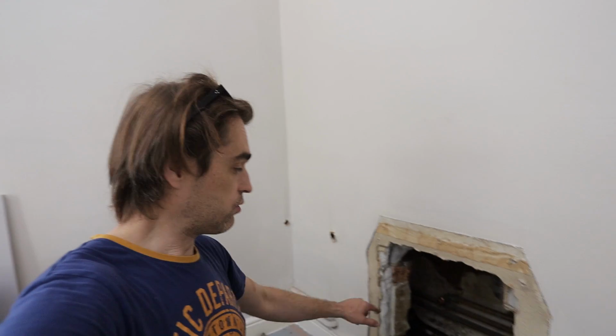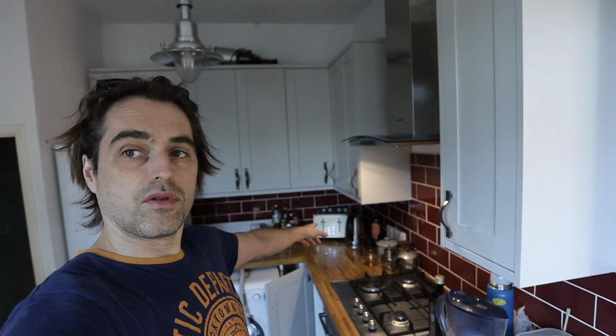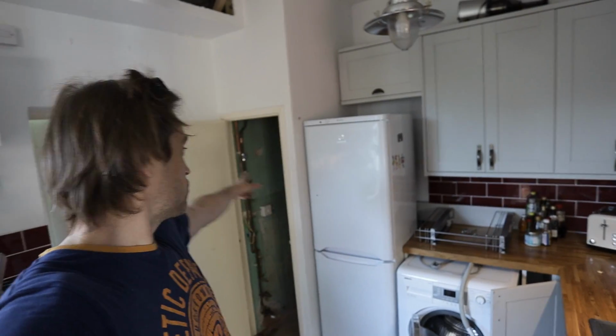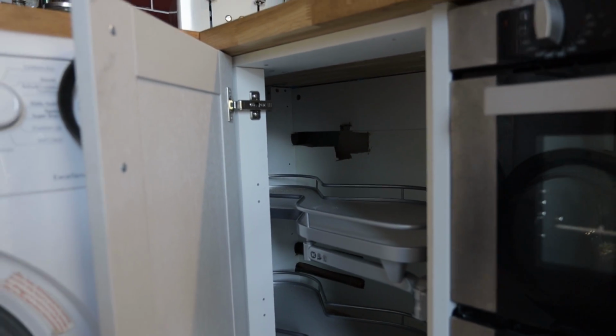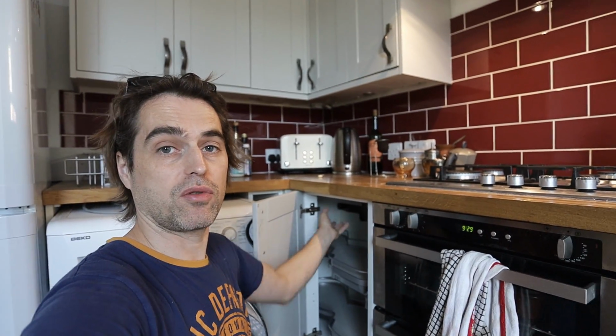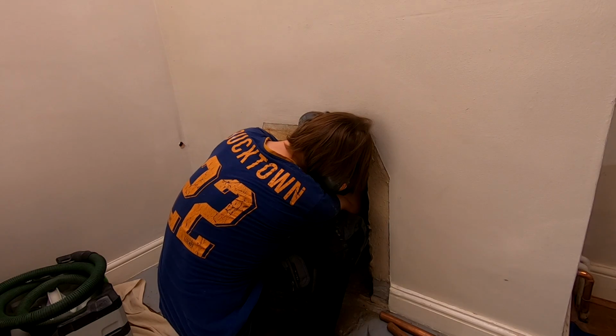I've got a bit of difficulty because I've got 2 options. I need to run gas from here to the kitchen next door, and it's quite a complicated route. I could go the old flow route, but it would require going exposed, or I could try to drill through half a meter of wall, because that's what the chimney and a partition together are, and try to come out behind the kitchen unit. I'd need to go behind those units, behind the fridge to the airing cupboard, and the old flow used to go right there, but I have no access behind the unit to solder that elbow, so I would have to cut out a bit of the unit. So what I'll try to do first is drill behind the unit and push a pipe through, and hopefully come out behind the washing machine.